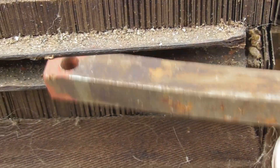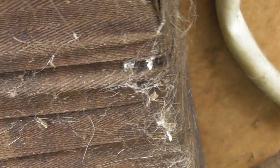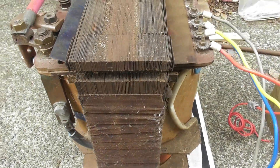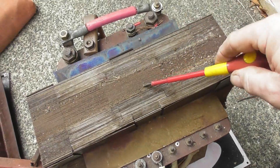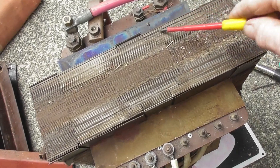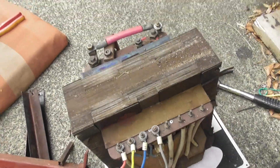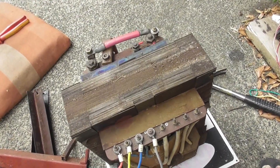There you go — the pins are out. Now I've got these square clamping bolts in here. There's a retainer in here with insulated medium to reduce circulating currents, and it's packed in quite hard. It sits around the metal so it doesn't short out the laminations, reducing circulating currents in the transformer. You can see the way the pack is made — you've got the middle limb and different sized laminations. I'm going to take this thing apart and I'll put it on fast forward.